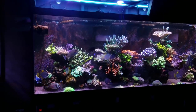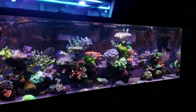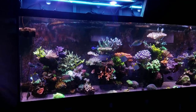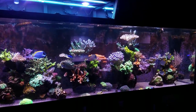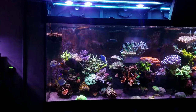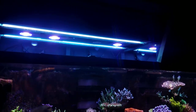Since it's not the power supply — they had me swap the power supply around with another XR15 — the light actually kicked on for about 20 seconds and then turned off. It flickered a little bit and then turned off, and then the light that had the original power supply is working with no problem. So it's not the power supply. I also updated the WXM module and again the light kicked on for about 20 seconds and then turned off.